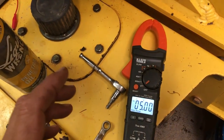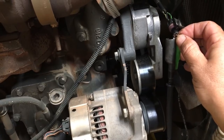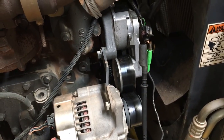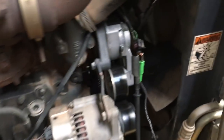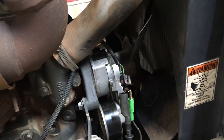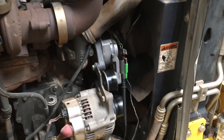There's some electronics on this backhoe I've never quite understood and I'm trying to figure them out. What I'm assuming is: since the voltage changed on that side, that's the one that controls the actual grid heater. So if the temperature is below a certain degree when you turn the key, it'll say 'wait to start,' and if it's above a certain temperature it signals that we don't need wait-to-start. I could be wrong, but I'm pretty sure that's what's going on. I'm going to hook up to the green-black, which I believe is the temperature sensor wire.